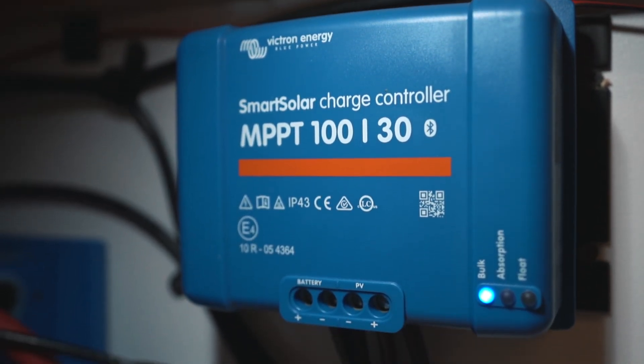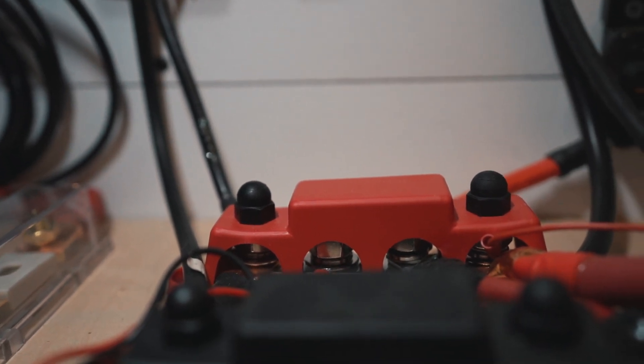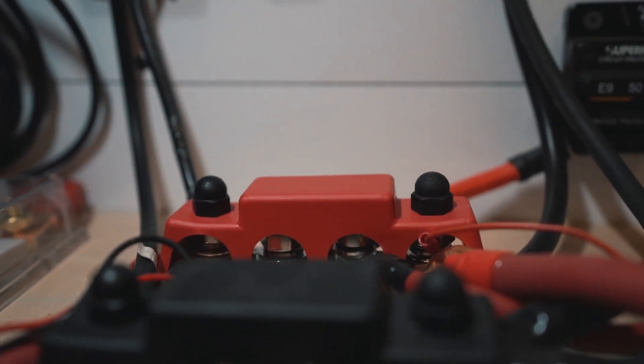So you have your system and all your little components — how does it all fit together? Every component in your system has a positive and negative side: your batteries, your fridge, your outlets — everything has positive and negative, and you just need to connect them all together. It's a little more complicated with bus bars and breakers, but take it step by step and it'll make sense. You have your solar panels with positive and negative, so you need that energy to go through your solar charge controller, then from there to your system. The best way to consolidate all your systems together is bus bars — they're basically big terminals. Instead of bringing the solar stuff directly to the battery, you extend the battery terminals basically — connect your bus bar to the battery and you have extra terminals to connect everything.